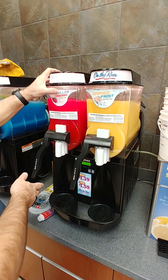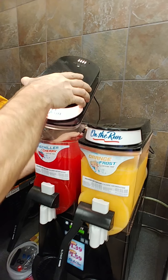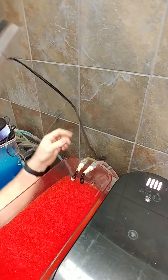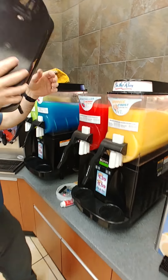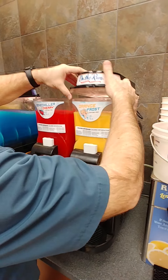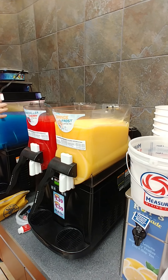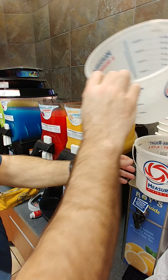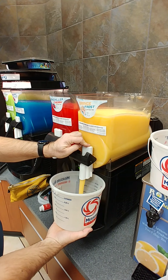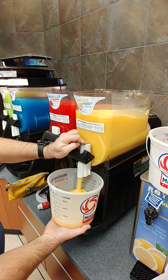Since the machine is turned off with just the augers left on, I need to take the hopper lids off. Because they're lighted, there's a plug on the back of them that you unplug from the back, and then I just set them out of the way so that we can begin emptying the machine. Then I take a bucket and just start emptying the product, and once we get it emptied, we will disassemble it and start the PM.